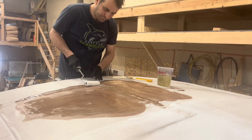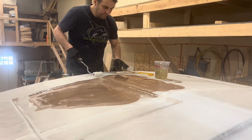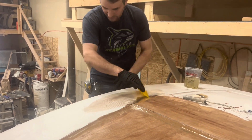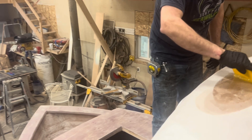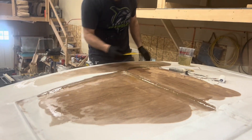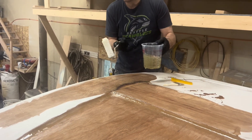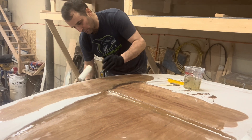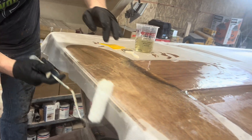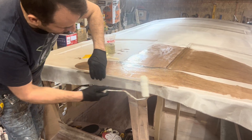I'm wetting out a little cupping here. Up here at the front, here's how you do an outside edge. One thing we should have done up on the hood is put a piece of cardboard, but if I'm careful and work this edge I can roll it around. You have to wrap this open grain here — you can see this open grain, you need to wrap your glass. We have that all pre-routed. You must wrap around — you cannot have open grain plywood.